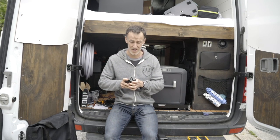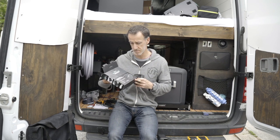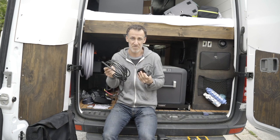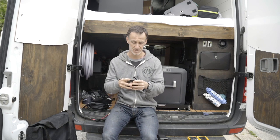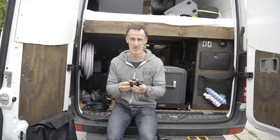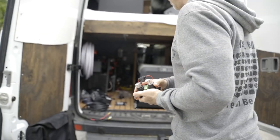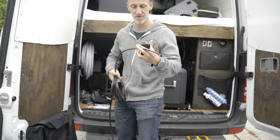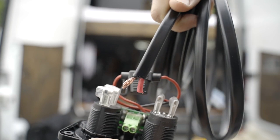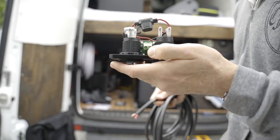I think I figured this out. I'm not savvy with this stuff and I'm surprised I didn't see a video on it. We got this wiring kit — should make things easy. It basically came with this and this. For some people this might be super easy; for me it's a little intimidating. I haven't really made connections and done that stuff. You take this apart — if you're getting this and you're new like me, it'll look like this. What took me a while to figure out is the connection terminal for this is this green piece that's already in there. You strip these wires a little bit and those are going to go in there, and you use these screws right in there to clamp down on the wire.